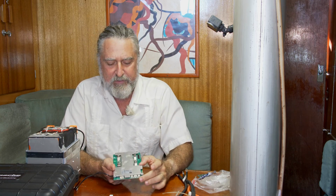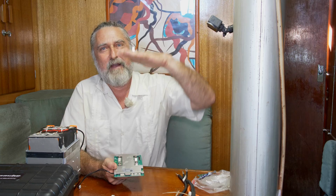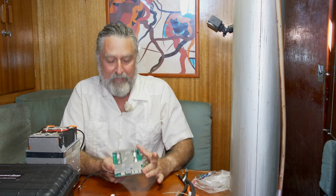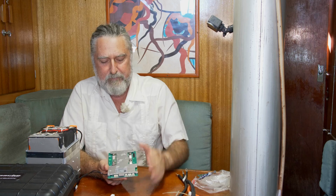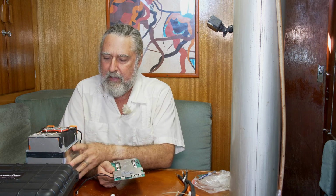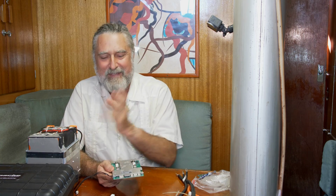But it has one extra trick. It will actually divert that power through this little pin, and I can run it through the heater. So if it ever got freezing around this battery, this device would actually warm up the cells, and then once they're warm enough, it would click and start charging again, kind of all automatically. Now, if this battery gets the life I expect it to get, it's going to stay in the tropics. That's kind of silly. But if you've already got the wires, why not?